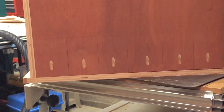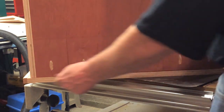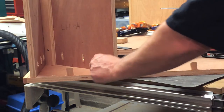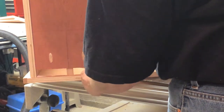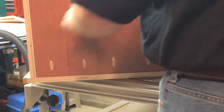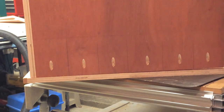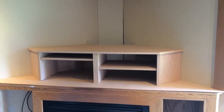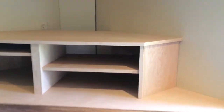One of the beauties of working with a domino - I had a gap here, but when I run the slots I usually make them wider than the actual domino, so that gives me some lateral adjustment. I just realized I could tap that over, and look at that - awesome! There's the dry fit. I still have to do a little mudding and taping behind it, but everything looks like it's going to fit up just nicely.